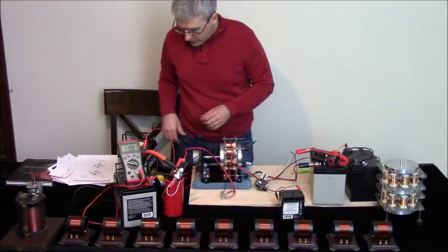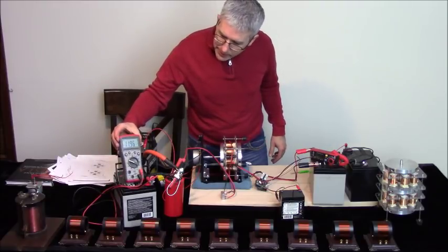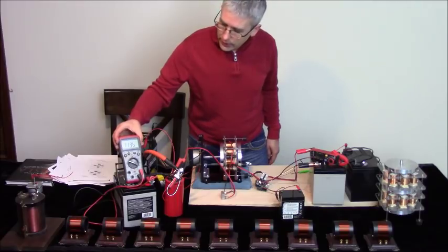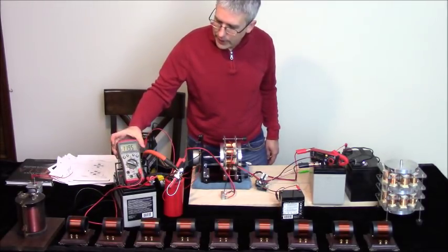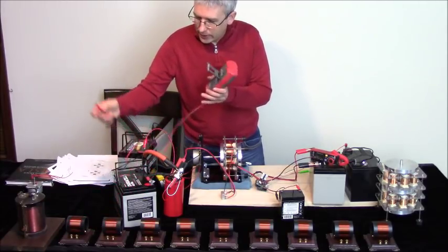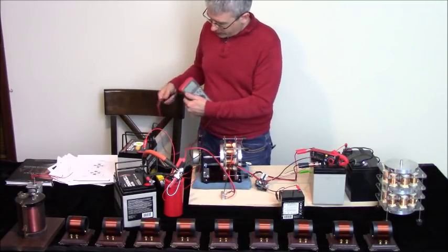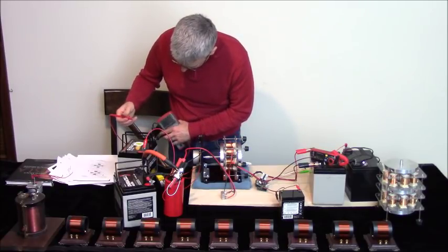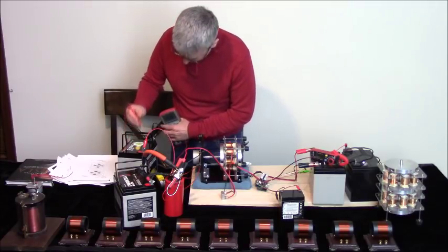This is not trying to show all the efficiency of everything, but you can see this particular battery is going to hold now. That's measuring pretty close to real charge. It's going to come down only a little bit, but this is 35 amp hour batteries here, and so this one, we'll just go over the voltages really quickly so you can see it. I don't want to make this too long of a video. 1266.